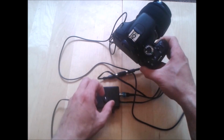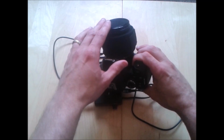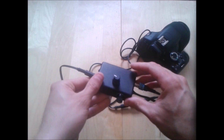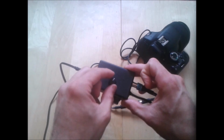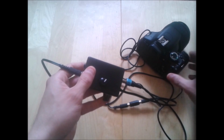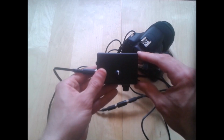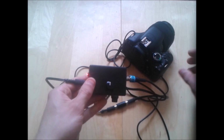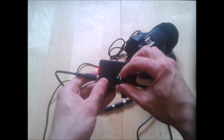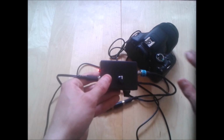Using this control knob, you can adjust how hot the intensity of your dew heater is, and that prevents dew from forming on your lens or your telescope. With this modification, it only draws a small amount of current, between 1 amp and about 4 amps per hour. Depending on the element itself, if you turn up the heat intensifier, you're going to draw a lot more current. Ideally, when you have the dew heater on and your camera switched on all the time, it's always best to keep the marking halfway. Keep it halfway and you'll reduce the power consumption a little bit. The bigger the battery, the more power, but this depends on how much you're going to use the dew heater. A halfway mark is more than ample, and it will stop dew all night long.